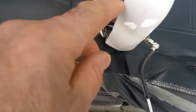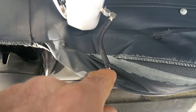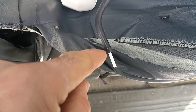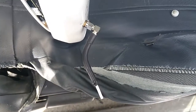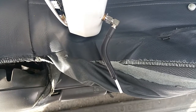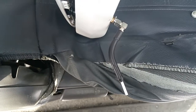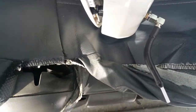I installed a coaxial cable and a 5.8 GHz external antenna. This is the ground and this is the active element — it's short, but it works. I've flown two kilometers away with this antenna, so this remote must have a lot of power going into the 5.8 GHz radio. I'll show you what antenna I use.